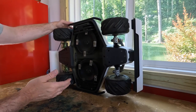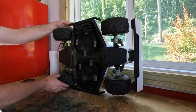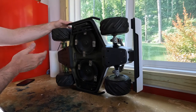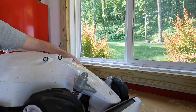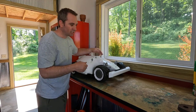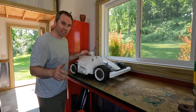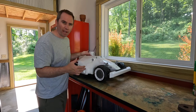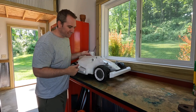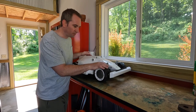Overall it's a pretty simple assembly that should be fairly reliable, but not very serviceable — unless you potentially take the hub motors apart and replace gears. Likely it's going to be an unbolt-and-full-replacement situation. Up top there's not much to do — four ultrasonic sensors, push sensors on the side, and the front bumper. I'm just going to make sure those components aren't loose and are clean, and give the exterior a car wash with a wax in it to keep the surface a little dirt resistant. The tires are solid rubber, so there's nothing to service there.